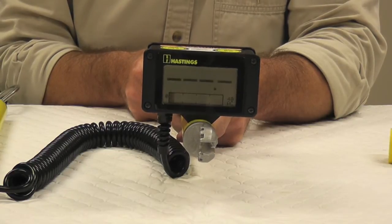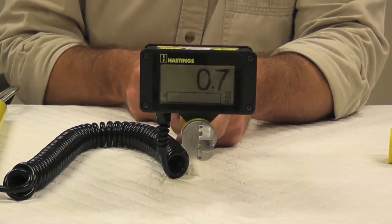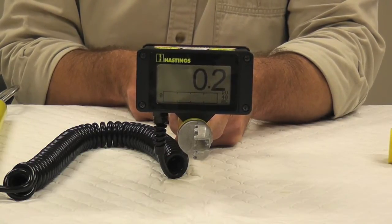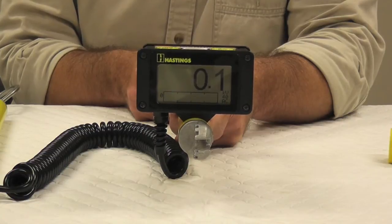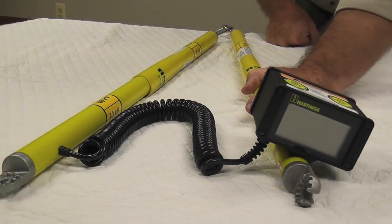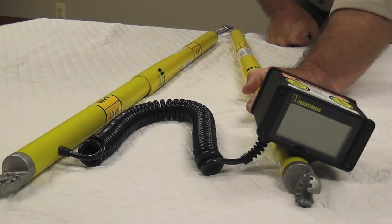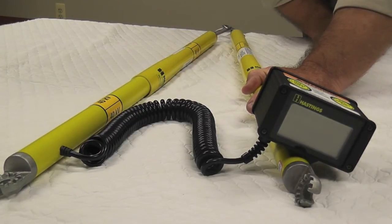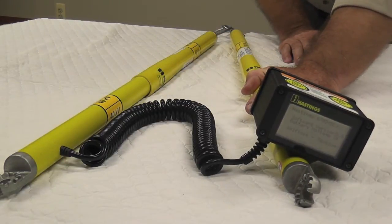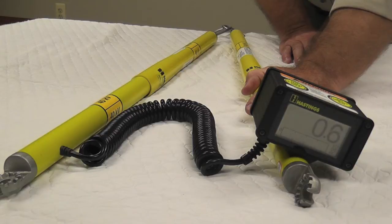In the text at the beginning, it asks you to touch the tips together. What this does is sense how many resistor sets are installed on the unit and automatically gives readings accordingly. When adding resistor sets onto the 6702, add the necessary amount of resistors before you turn the unit on. Make sure the tips are touching, turn the on button, and after its self-check, it will sense the amount of resistors added and show the new voltage limit in the bottom corner of the window.